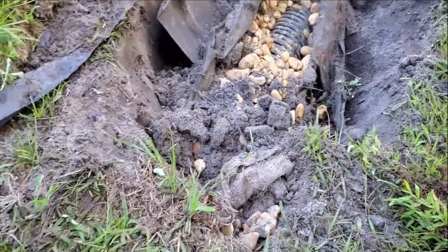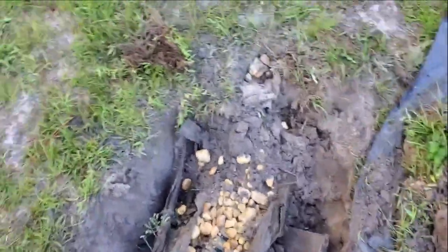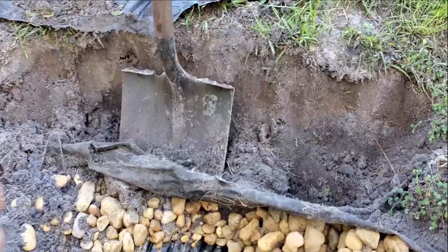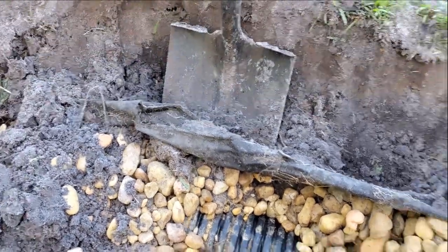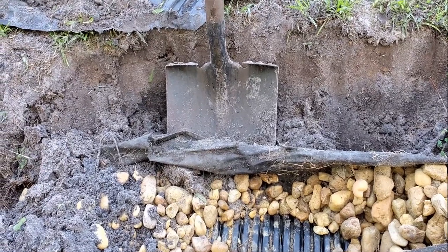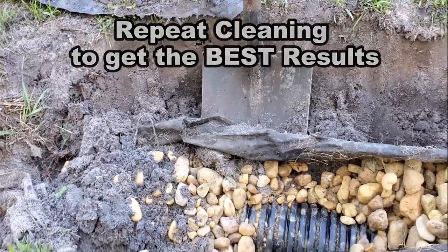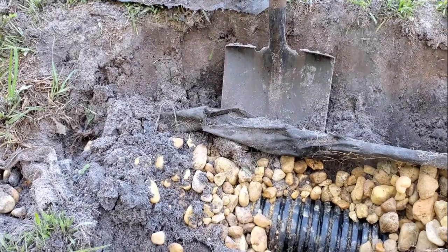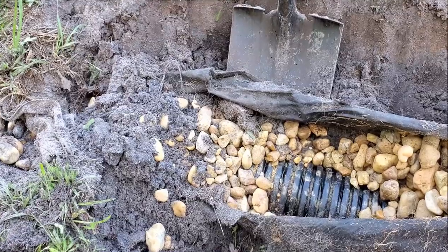See that water coming out? Hold that — don't pull it. That actually cleaned the debris along the side. See there's no sand here — that jet cleaned all this debris. It did a really nice job. Remember to keep your pressure running as you pull it back, because that's what's doing the cleaning. Those back jets are pulling back all that debris to the point where you started. Keep pulling it back. Very clean line — look at that. Beautiful. Shut it off and pull it out.